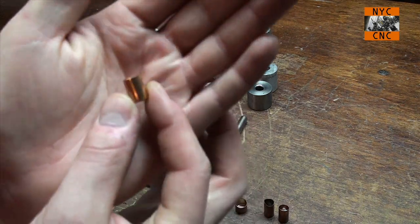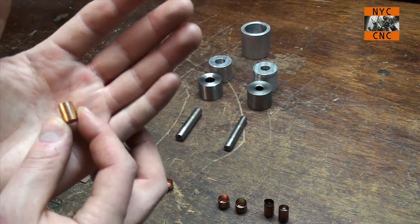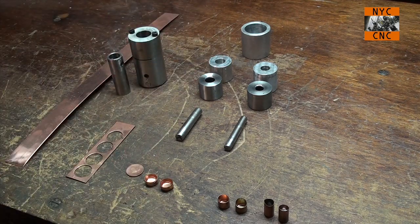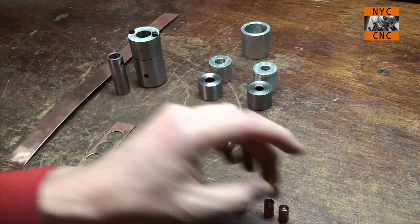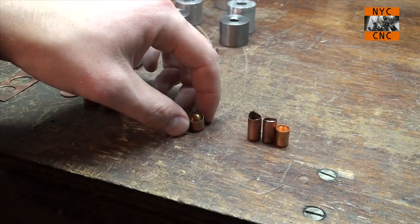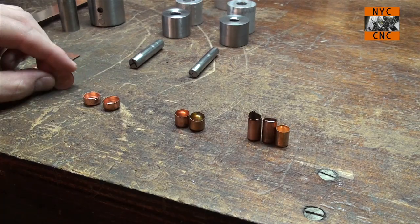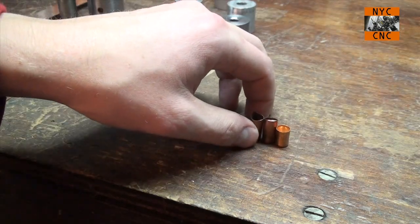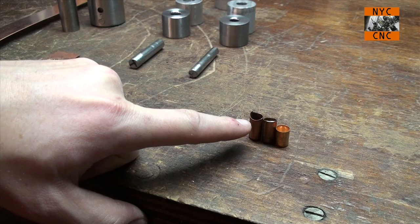This is the commercially purchased blank, but it's too short for the bullet weight that I want. The solution from the company was to buy a larger diameter jacket and draw each one down, which is why I thought, well, that's hogwash — I'm just going to give it a shot. This is a half inch long; we guessed about 0.6, and sure enough the draw-time math I was estimating with was pretty darn good. Starting with the coin size we have, we end up with a jacket that is a little more than a tenth of an inch longer than what we wanted, but that's good because the last thing you've got to do is trim these down.